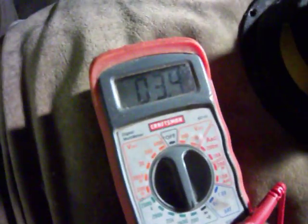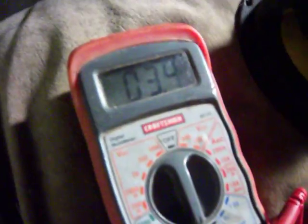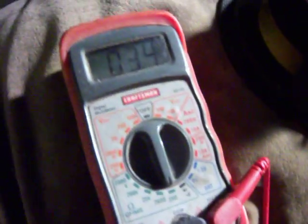Now we've got two speakers and we're at 3.4 ohms. This is with two speakers hooked up — they're both 4 ohm speakers, so it reads a little high. But safely you can run these two speakers no problem, even bridged on that amplifier.